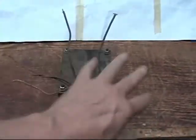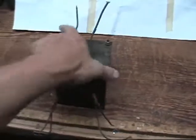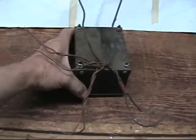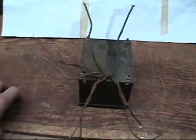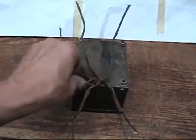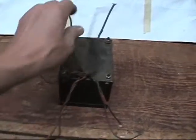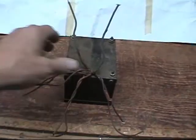You could use an ohmmeter, but if you use an ohmmeter, make sure you do not have this part connected up. I've had this transformer here for too many years to even count — it's another item I want to get rid of. Something like this, the only thing you can do is ohm it out, put it to a dim bulb tester, and voltage it out. Check it out that way and you'll get an idea of what it is.